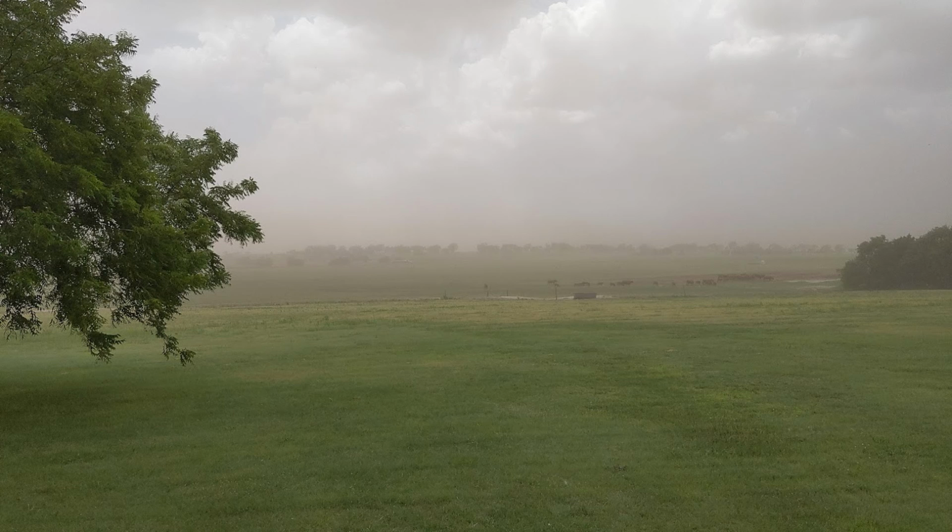So with this system here, we make sure that we keep the dust out, we keep all the unwanted air out, we bring in the fresh air that we do want, and we exhaust the stale air that we don't want. It's not as complicated as it sounds. I'll be walking you through step by step as we get through the process, but today we're air sealing. So we'll see first what this thing blows before we air seal it, and then what it blows after we air seal it. It'll be interesting because this is a Zip-R house.